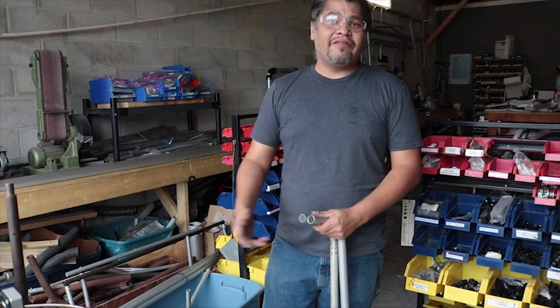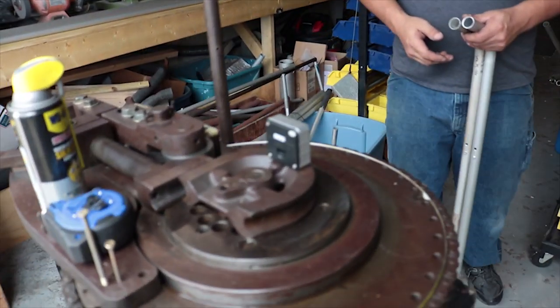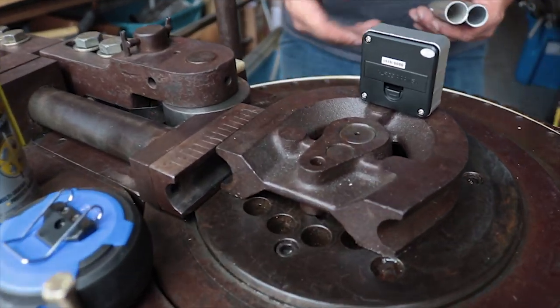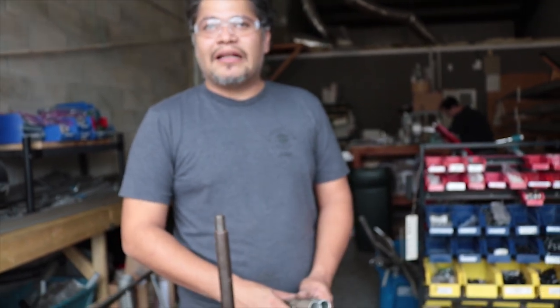And depending on the weather, sometimes if it's real cold, real hot, you can get different spring backs on it. Even from batch to batch, it can vary from the supplier. You just go back and adjust accordingly? Yeah, so you go back here and tweak. Typically, you want to underbend, that way you can go back in and bend it a little more. If you overbend and you want to bring it back, that's not always a good thing, bending stuff back the other way.